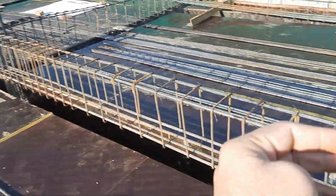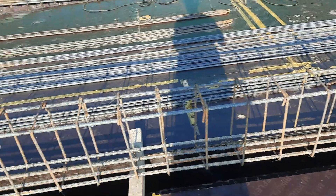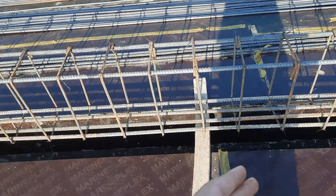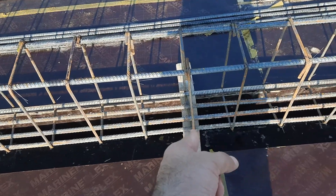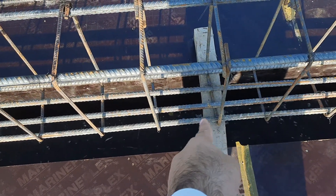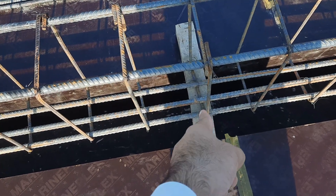The span between these two columns is about 22 feet. If the span is 22 feet, the center is at 11 feet. Do not provide lapping at this center location. They didn't overlap any steel rod here — I am just guiding you not to provide lapping at the center of the beam or the center of the RCC slab.